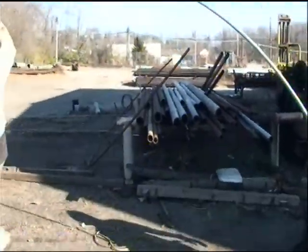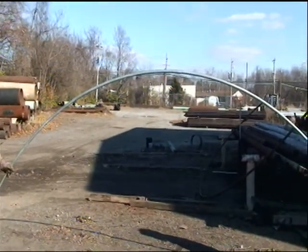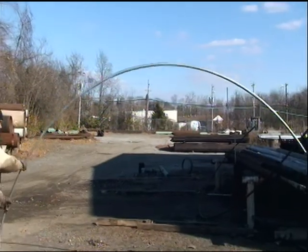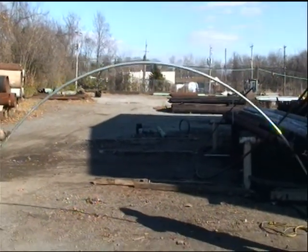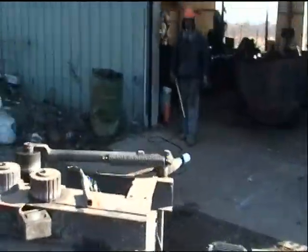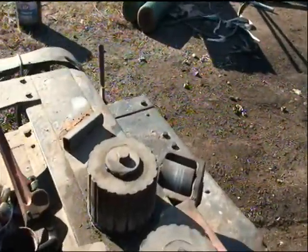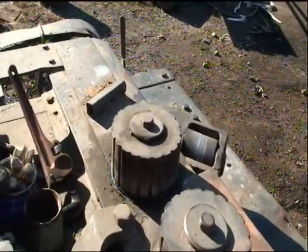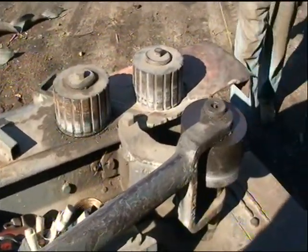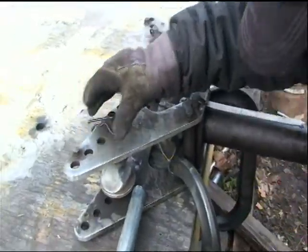Well, that didn't work too well. That first one looks like it's more like 16 foot wide and it's not tall enough when you stand in it. So push it together. Is that a 21-footer we used? Yeah, it's a 21-footer. So what that means is we have to go back and tighten it up a little bit so the hole gets a little smaller — to make a tighter radius of bend, this wheel needs to go in a little bit. The way you do that is take this nut and adjust it half a turn to make it go that way. You may have to play around with it once or twice. That's all you really need to do. So the final part of making a 30-foot hoop...